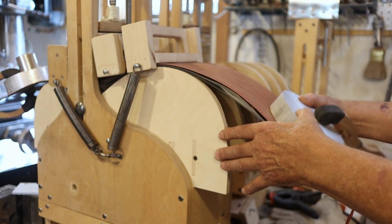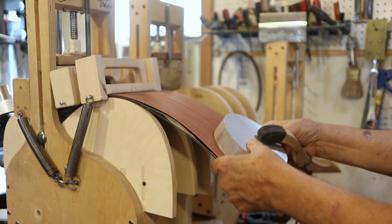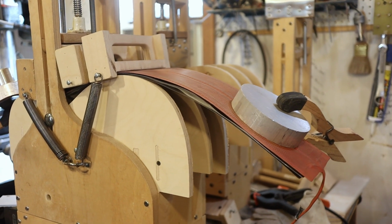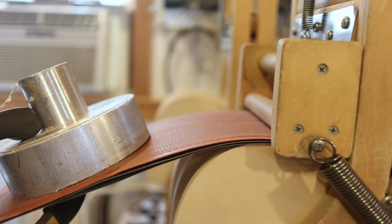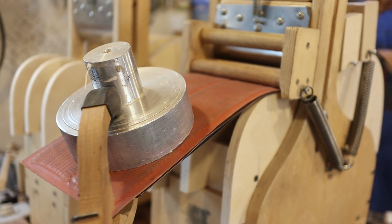And you can feel that the wood is starting to relax, and you can feel the heat coming in underneath here. So the reason I use a Windex with ammonia is that ammonia is a natural cell softener. So it makes the bend more efficient because you need the cell to collapse.